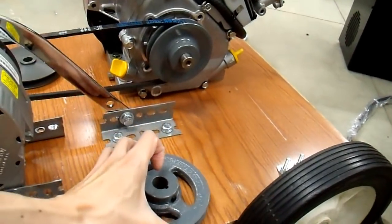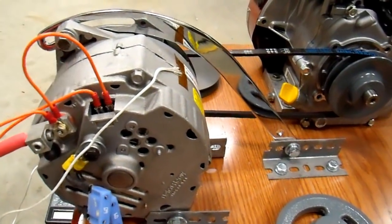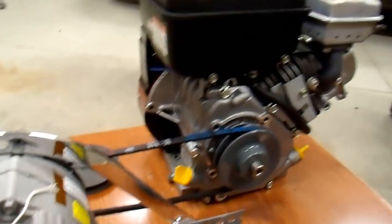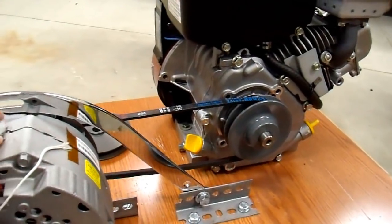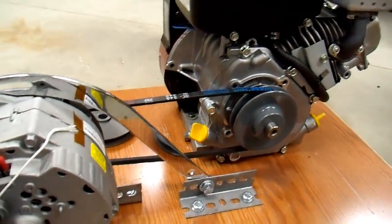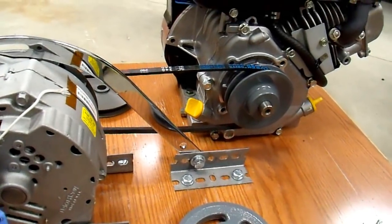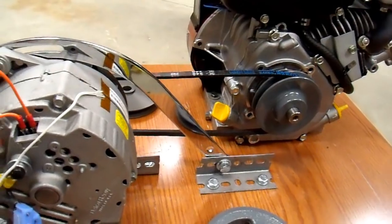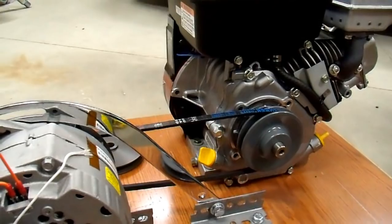So I'll just put that belt on there and give this thing a try again. Hopefully I can now get the desired 80 amps out of the alternator — we'll have to see. Also, as I mentioned, this engine was laboring pretty hard with this inefficient setup with the small diameter and high speed on the alternator. So with this better setup, which is basically a 1-to-1 ratio — just like I wanted to start with — hopefully everything will work out okay. I'll have to put this on here and find out.